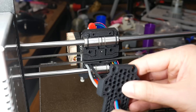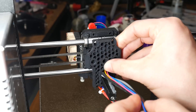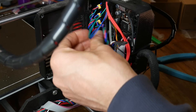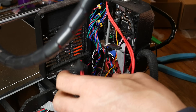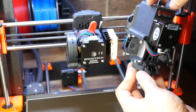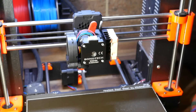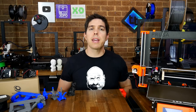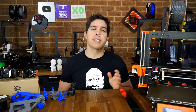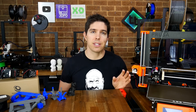After this the X-axis belt can be tensioned. The new backing plate that comes with the kit is then moved into position, and a total of five M3 bolts are used to hold it in place. The loom can then be wrapped, cable tied, and fed back into the main board with everything reconnected to finish our install, which is looking pretty tidy. Because of the extra disassembly as well as the extra parts in the adapter kit, I think it's safer to leave around half a day for this one.